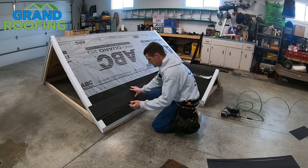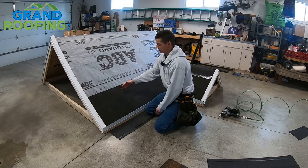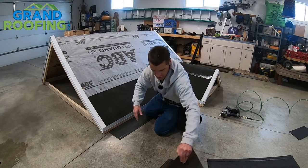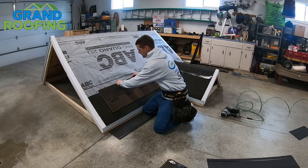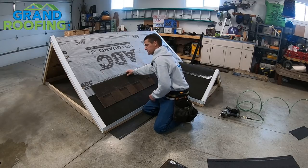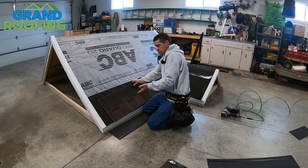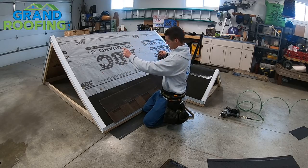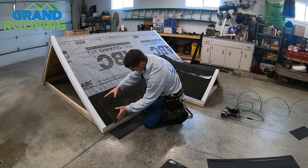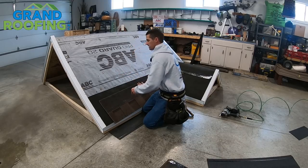We're going to get into building the pattern — the lead. You got your shingle line cracked for your starter and your first shingle. Typically we do about three lines and then go up every 22 and a half inches, which gives you every fourth row an area for your line to hit. You mark it for the tops of your shingles — if you marked for the bottom, your headlap would cover the line. We'll mark from the top end down in increments of 22 and a half, do a little math for the bottom three rows. You need at least three rows to stand on before you turn around and start roofing up, hitting your target lines and making sure you're straight.